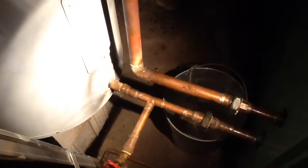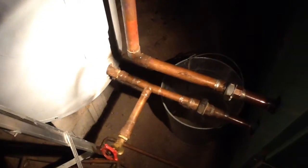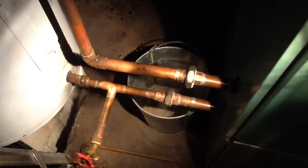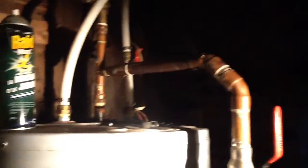That's one thing to know when you're running a hot water boiler: make sure there are no air locks so it can actually cycle around. If it stops thermal siphoning, it's going to create even more air as the water boils in the coil. So that's a bit of a gotcha for wood boilers.